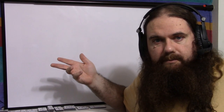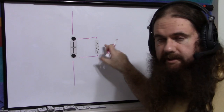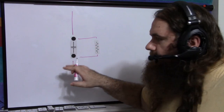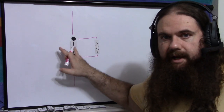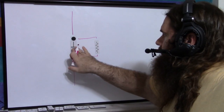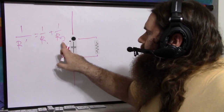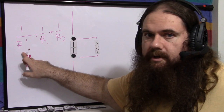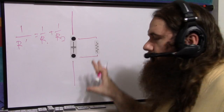So you want to drain that while the system is off, and this is where a simple bleeder resistor comes in. If you have a capacitor doing whatever, you put a large value resistor in parallel with it. This operates on the same principle as a multimeter or oscilloscope does. The capacitor at any particular moment has a reactance, basically approximated as a resistor based on frequency. So with parallel resistance and a small resistor alongside a large resistor, the small resistor contributes way more to the actual resistance value.